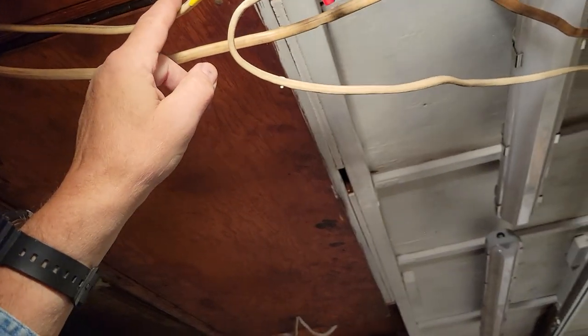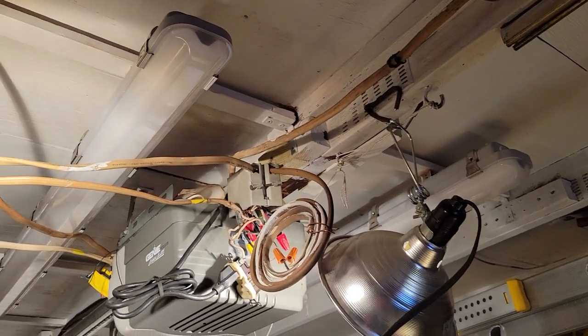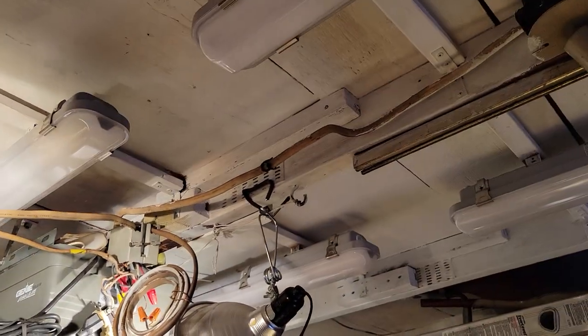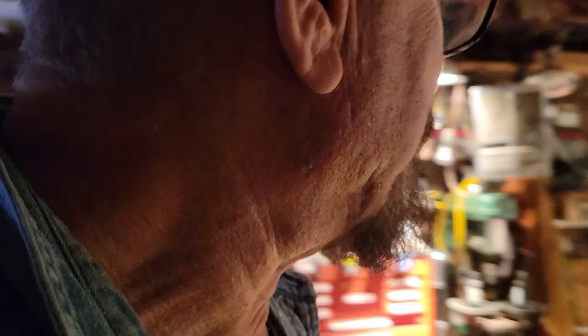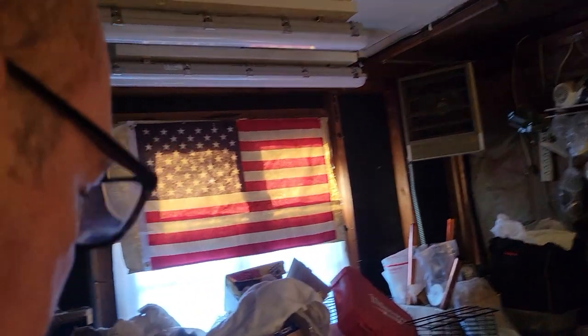The problem is this is the live line that feeds everything. You see all this junk — it's just crazy. My dad didn't give a damn about surges or any of this stuff, and there's nothing on the lights. We've been running everything out here on 15-amp circuits — it's nuts. Until I brought 10-gauge wire out here to run the 220 motor, that's how it was. Anyway, all that stuff is going to be fixed and made right. Thanks for the support — just knowing you're there helps. Let me get in and spend time with my wife and I'll get back to you as soon as I can. Thanks for joining, bye.